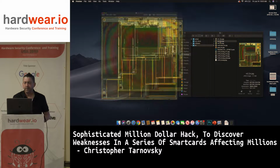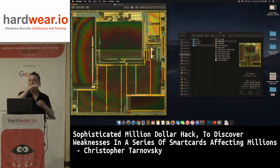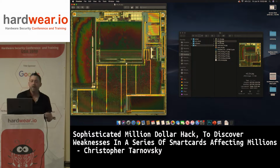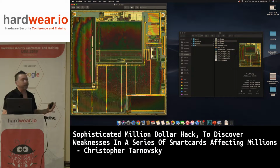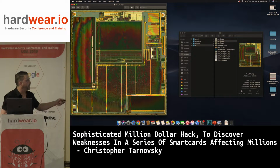You can see here's Metal 2. You can kind of see as we're getting lower on the chip. Again, I took several different devices and polished them on a lapping machine with this silica solution. This is the next layer down. So this is 2 chips now that got destroyed in the process. I went through probably more like 10 chips to get 4 perfect chips. We've got Metal 1, Metal 2, Metal 3, and Poly. Poly's the transistors, Metal 1 is the logic, and everything above is wires routing like on a PCB.